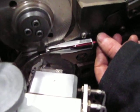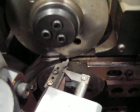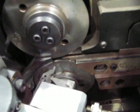And then there's a little flat lapping tool. I'm going to start pushing in, and it comes in right here. It comes in as the part is spun between these two steel wheels. This flat lapping wheel, which is held right on the tip of this tool holder, comes in and is held in position, and with the flat stone laps the part. Then it retracts, and the mechanism that holds it between these two wheels releases, and the part drops down through this little chute here and out as a finished product.